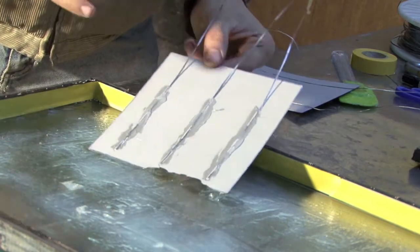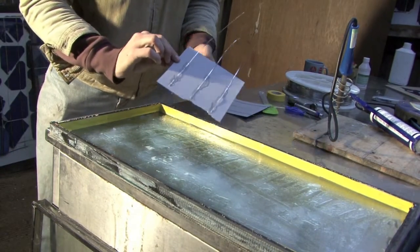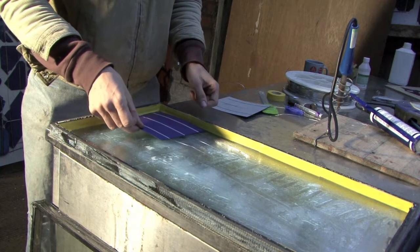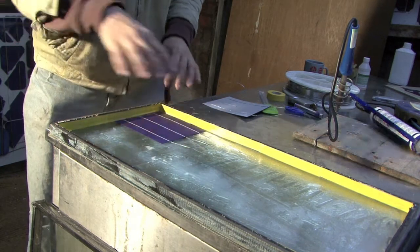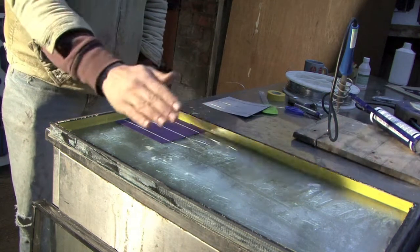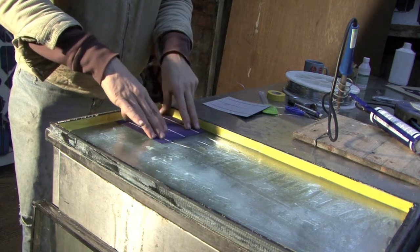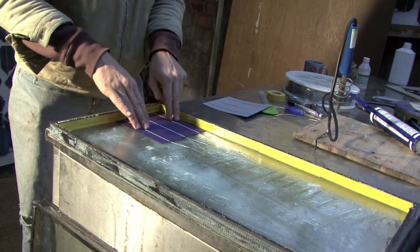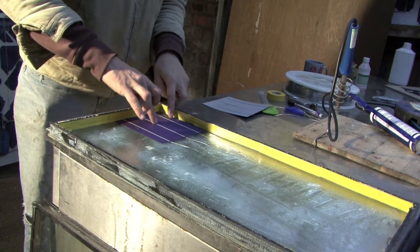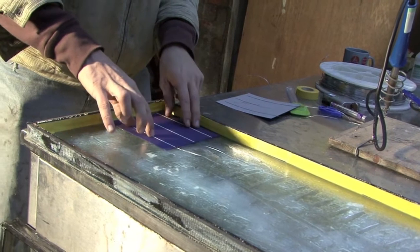Once we've covered them in silicon — you don't have to use your fingers, you can use something else if you like, but if you do use your fingers it's not going to kill you — we'll flip it over, place it down, remembering the spacing we wanted to achieve when we laid them out right at the beginning. Very gently, because the cells are ever so slightly convex, so you're pushing down on something that's a bit more fragile. We'll put that into place so it's sitting nicely in the silicon, and run our fingers along these white lines at the top to make sure the connections are really nicely stuck in and encapsulated.